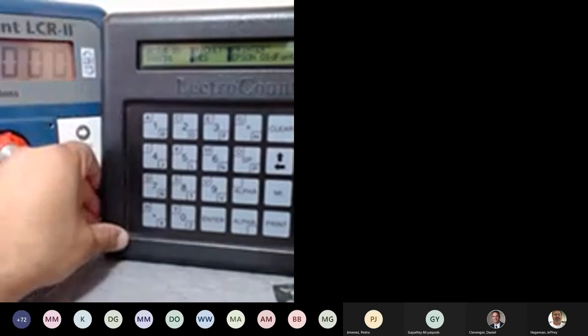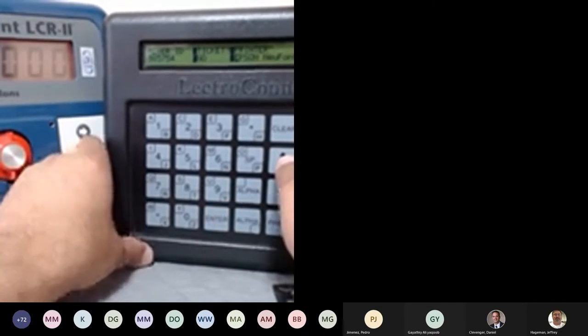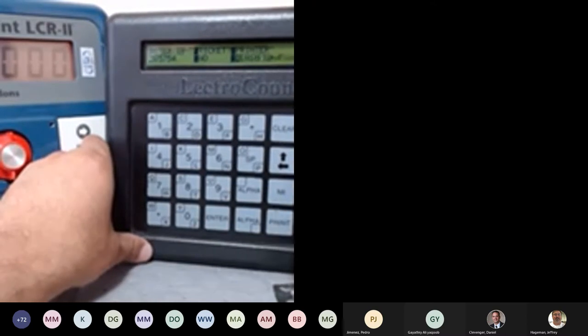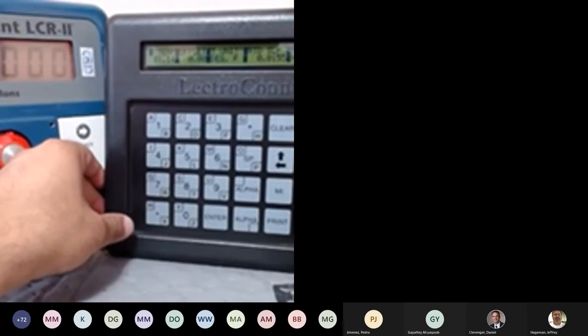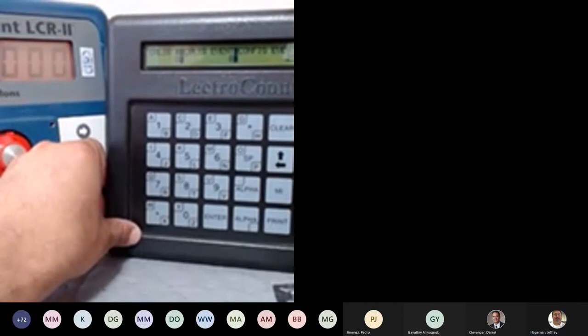Great, thank you. Okay, so I go to the system setup. Basically, I'm going to press enter. You have a meter ID, which means the serial number from the meter. Ticket, yes or no, I can change that to yes or no. We'll leave it as no right now. So these are the printer types. Again, you have the old font, new font B, especially new font B for the roll printers. Or I can hit the M pound key. It's going to take me to the next selections, temperature, flow direction. But if I want to go step by step for each field, I can just use the arrow right key and keep scrolling.